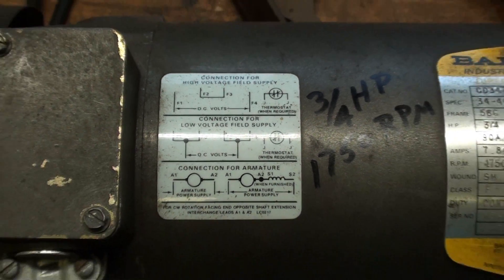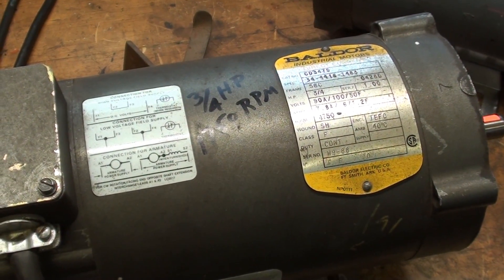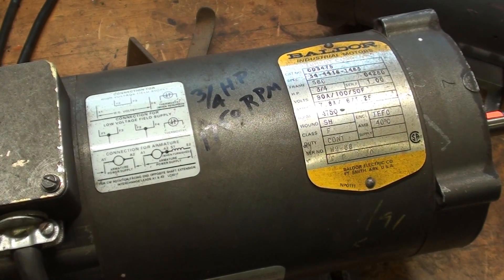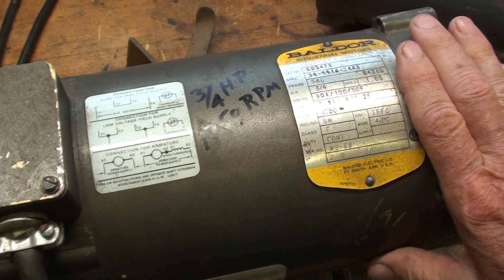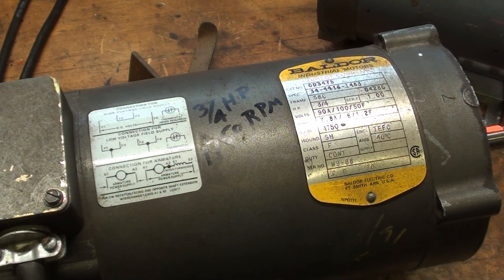Remember that you can use a DC motor with a controller and vary the speed. You can't do that with an AC motor other than with a variable frequency drive. I've been warned that I won't get good torque at low speed, and I guess that's true. But that's what this series of videos is all about — drilling and sawing at low speeds, getting away from that high-speed woodworking stuff. Metal workers need slower speeds so you don't burn up your cutting tools.